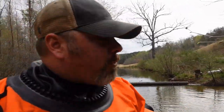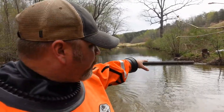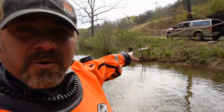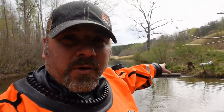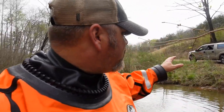And just to show you what we're doing, this is the intake system here. That's a float that you're seeing, and directly below the float is the actual intake pipe. If you look just on land, you'll see the new cap pieces, the filters or screens that go on the end of the pipe. When the company called us to replace the old screen system, they just assumed that it was damaged, that it wasn't there anymore, and they were sucking too much stuff up in this pipe. So they created a new flange intake or screen system. Our job was, of course, to get out here, take the old one off, or get the hardware off of it, and install the new one.